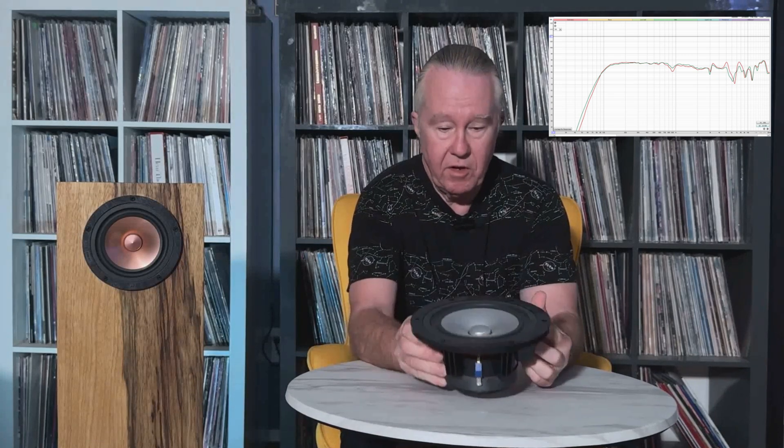So let's discuss what we do about full range speakers. We use ones that are called extended range. This is an extended range speaker — it's a Mark Audio CHR 120. It will play to 20 kilohertz, but not cleanly. Same thing here with the CHR 90. The CHR 120 will play very cleanly to say maybe 10 kilohertz. We cross it over around 2 kilohertz, so in the crossover region — let's say between 2 and say 4 or 5 kilohertz — it plays clean. So that's the goal here.